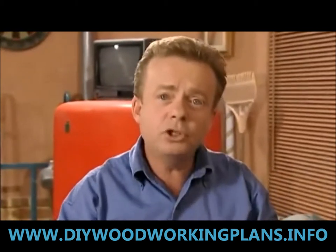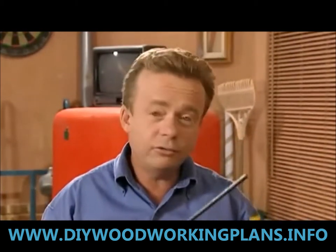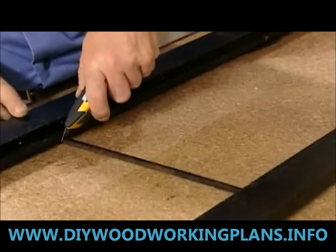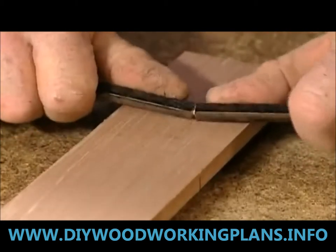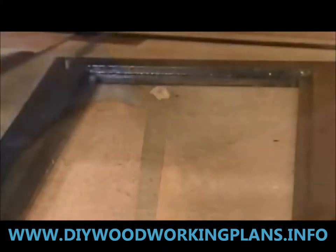We've marked the position of the back framing. This is the six mill by six mill moulding — it's really good because you can cut it with a Stanley knife. We place it in the frame and cut it so it's a tight fit and very accurate. The six millimetre beading cuts easily with a sharp trimming knife by rolling it through the four faces. We then snap it and leave the small burr to help hold it in position until the glue dries.